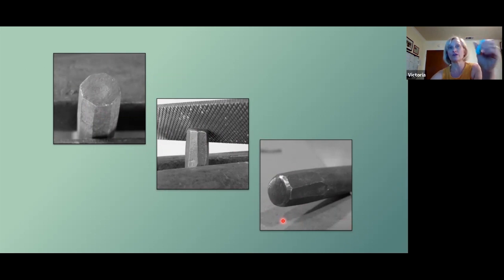As you saw a little bit with that chisel point, mushrooming is when, after a bit of use, this top part expands out and creates a little shard of metal ready to break off. And that actually is something you want to keep ahead of, because that piece can and has broken off and harmed people. Not too long ago, I heard of a situation where a mushroomed end, a little piece, broke off.